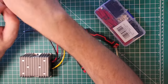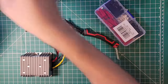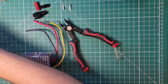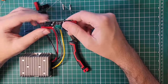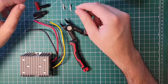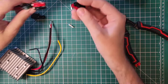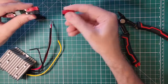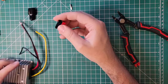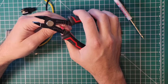Power poles are a pretty standard thing in my world. I need a bootie, a red and a black, and two of those spoon connectors. I always have something already made with power poles on it to use as a reference — this is a fuse kit that a friend of mine makes and sells. Power poles are great because they can only connect together one way once you get the connector made up — you can't put it together negative to positive without a lot of hysterics.